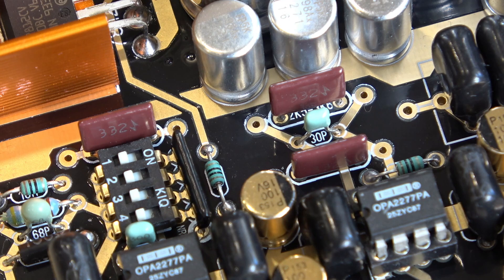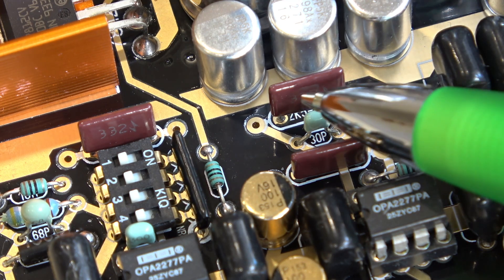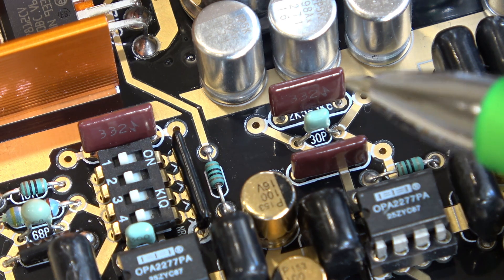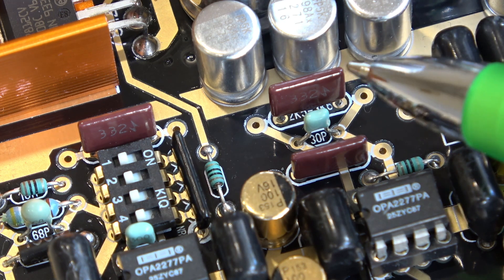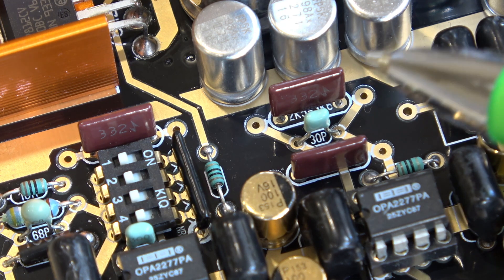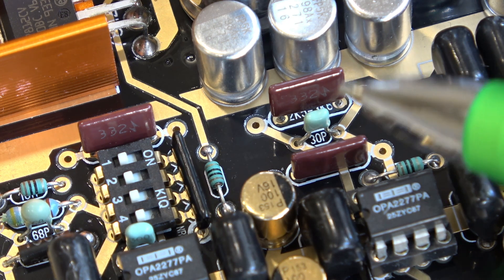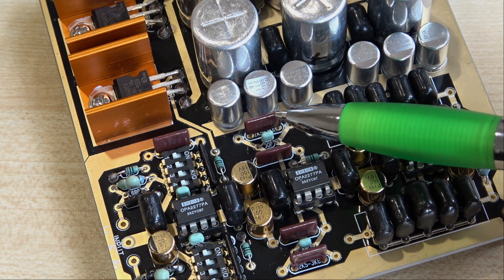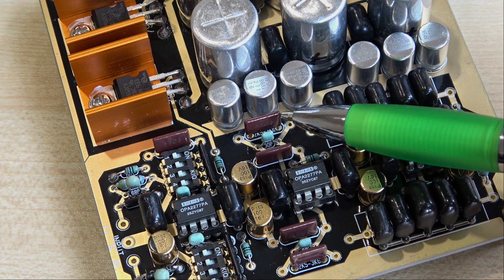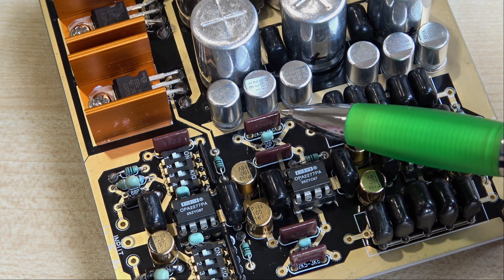Another component that was initially a little confusing — you can see this brown-looking thing. Looking at it straight out of the components box I thought they were capacitors, but they're actually resistors. You don't see them that shape very often — it's been many years since I've seen them this shape. Their claim to fame is they are very close tolerance. On the board they're marked at 2.5 to 3.6k, and you think, why would you want a close tolerance resistor when they give you such a wide range?